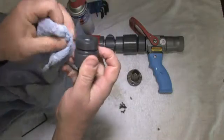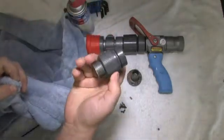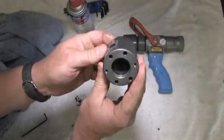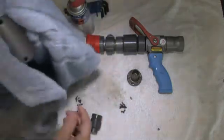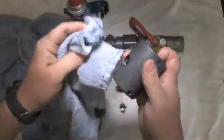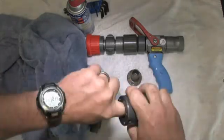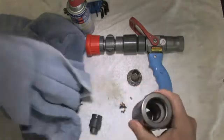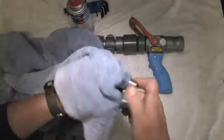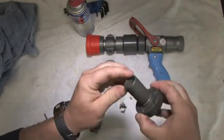While we have the check valve out, we can inspect the groove that the bearings sit in for excessive wear. We're finished with the one-way check valve and can now move on to the proportioner housing. Start by inspecting the housing for damage — even on a relatively clean unit, you may see some dried concentrate on the inside that needs to be removed. As we clean the proportioner housing, we want to inspect all the seals: one on the check valve side, one on the metering selector side, and a gasket where the pickup tube connects. The seals look good. Now let's take a look at the metering selector — this is another critical inspection point. If the one or two percent metering holes are blocked by dried concentrate, the proportioner simply won't work right.